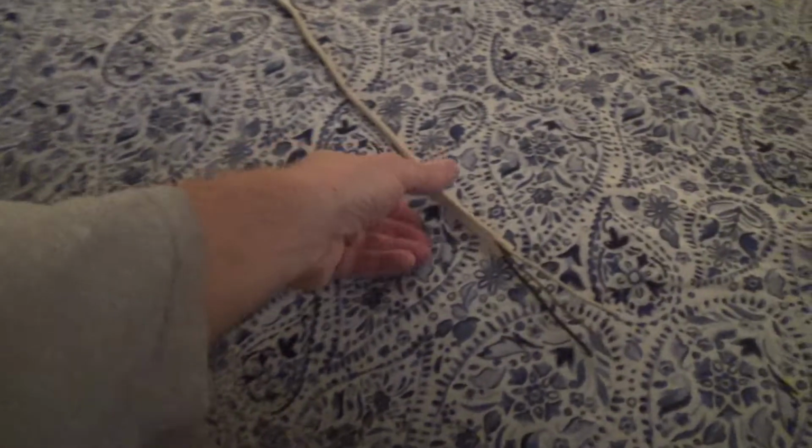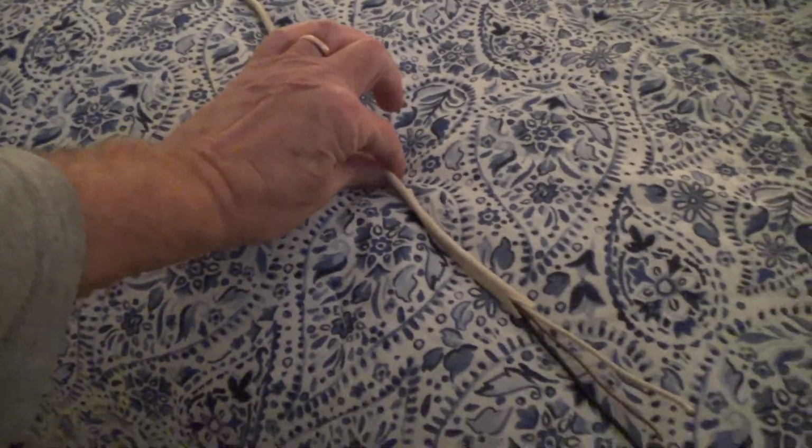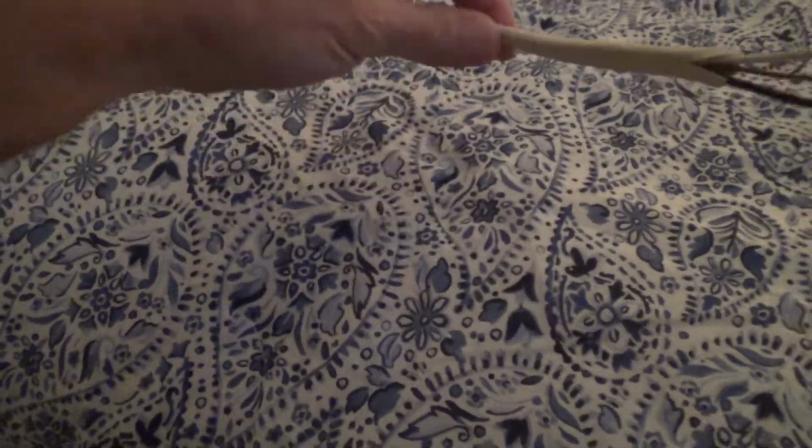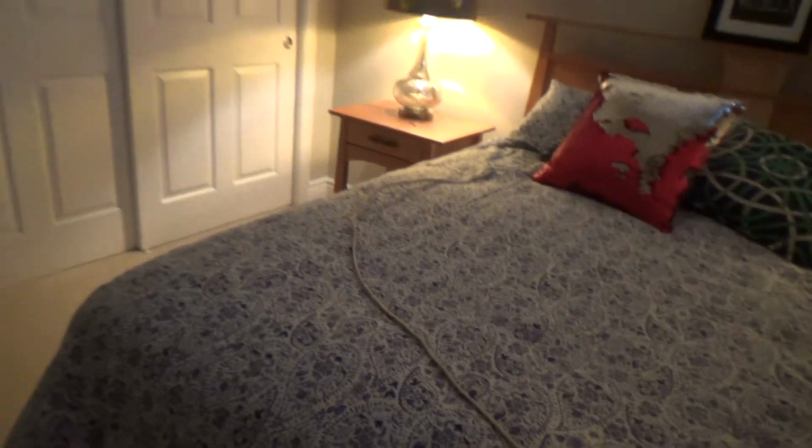And then we also know going up here across, when I have the cable up in there, I should route it in such a way to where I can staple it on the side of a 2x6 ceiling joist, 2x8 ceiling joist, or the trusses or whatever. And I'll get some staples, and they have two different size staples to go over this. If you're gonna put two layers of this on top of each other in certain areas, you get a bigger staple, or you get a smaller staple that's usually good for just one piece of this. So I'm gonna get a little box of staples because I don't think I have any of those. I'll have to look because I keep all my extra little things in one bag. So I'll have to look at that and see all the types of parts that I need for that.